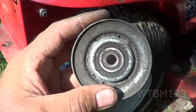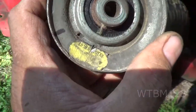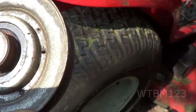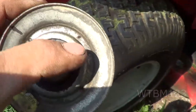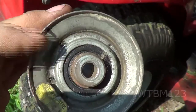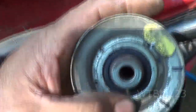Basically that pulley is three and a sixteenth diameter and this one is three inch, but I'm not sure what they got this one from — there's a sticker but you can't really read it. This one here's got a 6203-2RS bearing in it. You can see the little dimples there where they've pinched it together — it might be a little harder to put this one back together with bolts; you might have to spin it and weld them back together, but you could put a bearing in one of these.